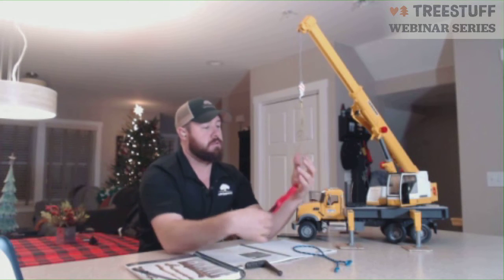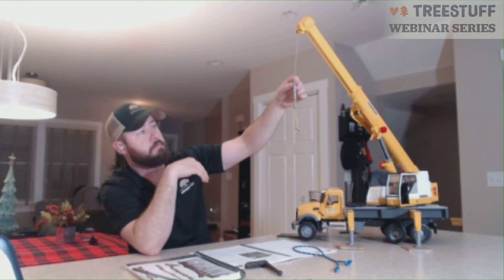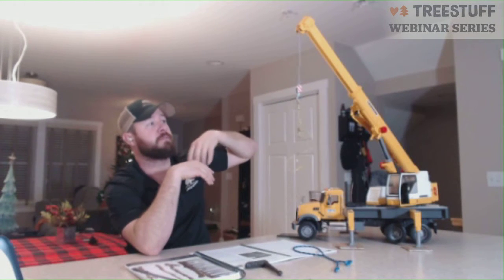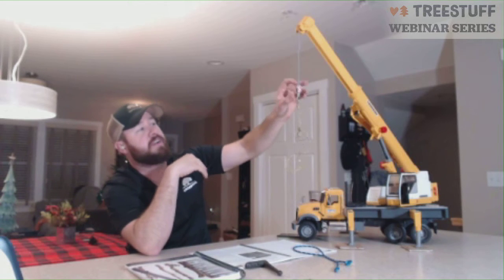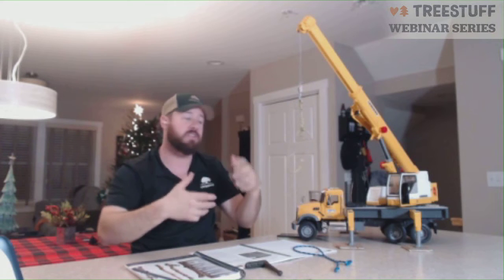They're talking about balls on the crane versus a block for tree work. Okay, so ball and block are 2 different objects. You have what's called an overhaul ball, which is where you just have a weight suspended from a single part of line. So what this crane is showing here is what's called an overhaul ball. We just commonly refer to that as the ball. We don't say the overhaul ball, it's just the ball. All right. And a block is when you have sheaves here. So it's a pulley and would allow us to go back up to the crane, creating 2 parts of line, 3 parts of line, 4 parts of line, and so forth. Both are utilized in crane work a lot with tree work.